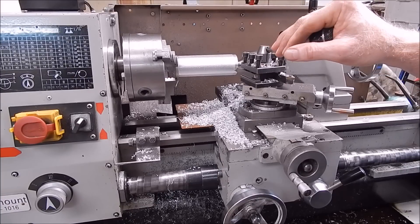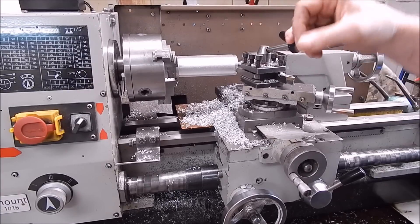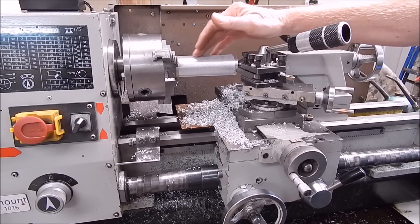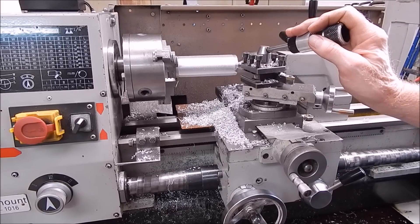Once again we're on our finest feed and machining towards the headstock with the shear tool. You can't go in very deep otherwise it can dig in and snag — no more than a thou. As you can see, I just did that with carbide and it really ripped it up. Now we'll go through with the shear tool and clean it up, and it should be a nice looking piece of homebrew aluminium.